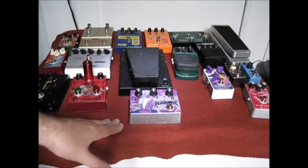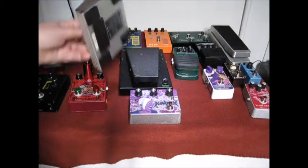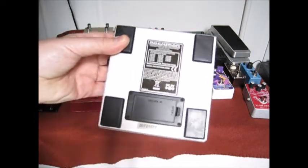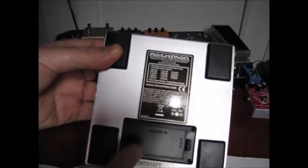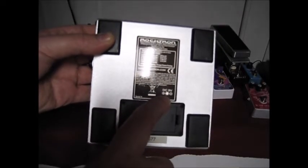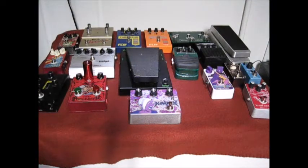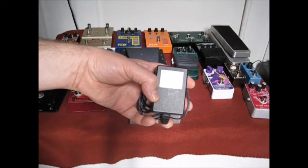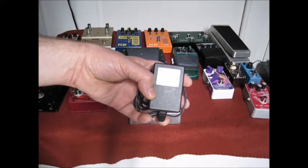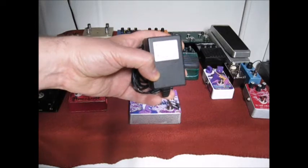Most of your typical solid state distortions aren't going to have a huge current draw. Many times the manufacturer will write something on the bottom to tell you about the current draw, but most of them don't — they'll just say 9 volt pin negative. The unit we use for testing here is an old Dunlop unit, capable of putting out 200 milliamps at 9 volts. It gives a nice, steady, smooth, linear power. They don't make this anymore — they switched to switch mode because it's allegedly better for the environment.